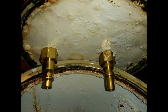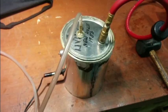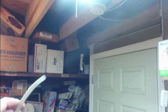to seal it up. I added a small puddle of mineral oil in the bottom of the can to wick into the fiberglass before sealing the lid. It does take a few minutes to warm up. I'd rather have that than something too hot that creates fire inside the can. By the way, I regulate my compressor to put out less than 2 psi before hooking it up.